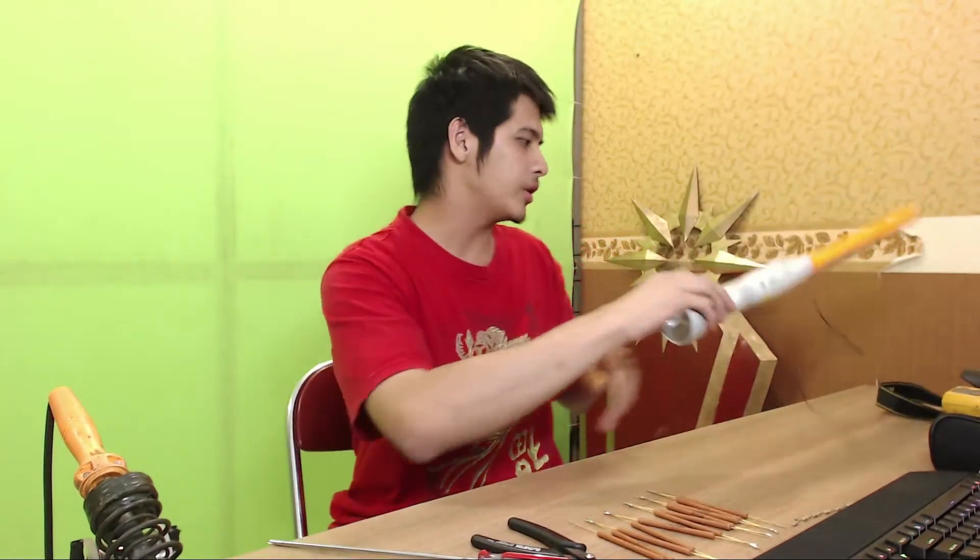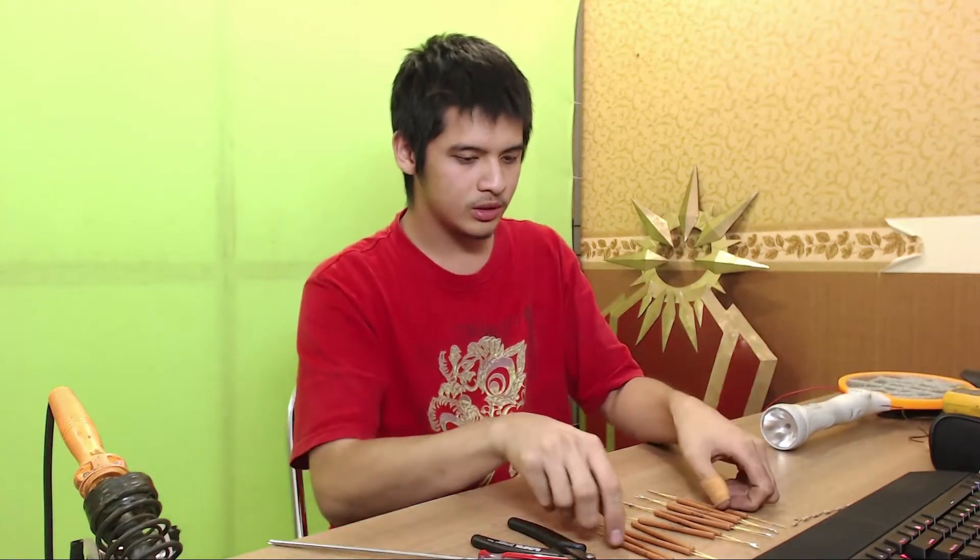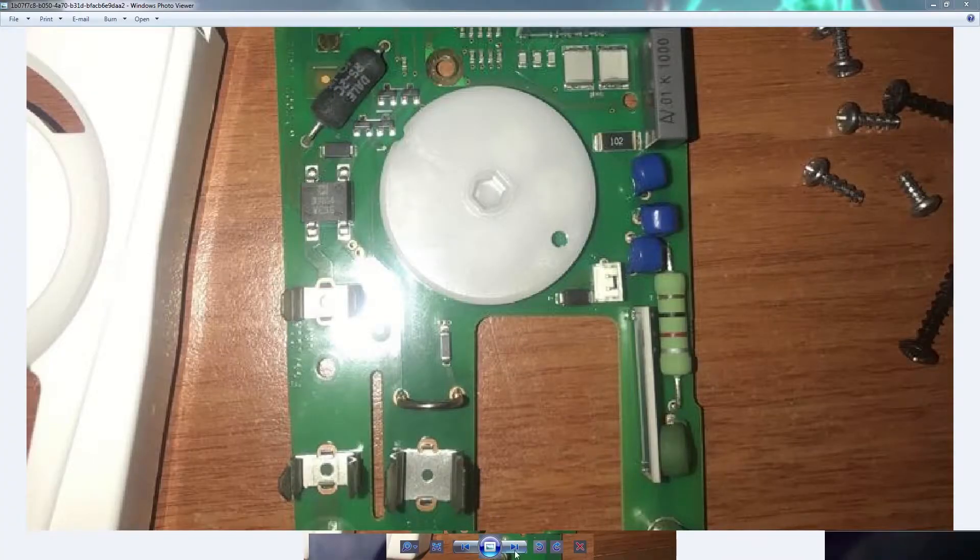So let's move on to how we're going to measure high voltage. What kind of voltage divider are we going to build? I have 300 megaohm Caddock MD-745 resistors - 300 megaohm, 1% tolerance. These cost only about 10 dollars a piece and I have 11 of them right here.